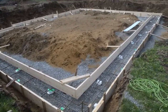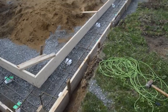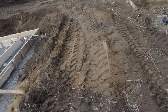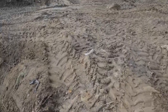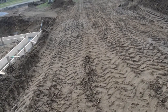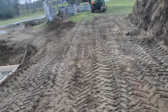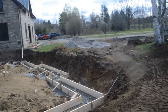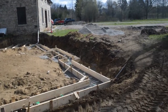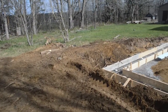Today's a good day — the sun's coming out. We painted a little bit last night. We are pouring footings today. All the rebar is in and spaced up, all the forms are in and staked down. We did some dirt work last night. Hopefully we can get the cement truck as far around as we can. The ground's wet but not really soft. I'm going to get the tractor going and give this a couple more runs now that it's damp on top, hopefully packing it a little bit more — those concrete trucks are definitely not light. I'll put a little bit of crushed stone on this pathway and cover the front and side walls, hopefully squeezing in along the back wall too.